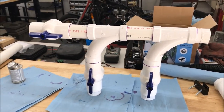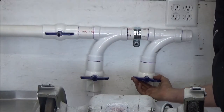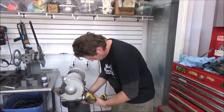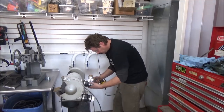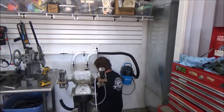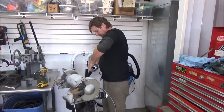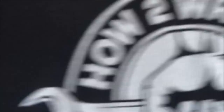Let's take a look at the setup. I'll glue that piece up to the pipe on the wall and get it secured. I was going slightly downhill to clear those outlets. One of my real deciding factors for this vacuum was the wall mount — super slick, and great to be able to grab it and go use it in other places. Those rubber coupling reducers made life really easy — didn't have to fabricate anything there. I even flipped the hose clamps so the tightening screw faces outward, thinking ahead for future maintenance. In the build list you'll see two sets of inch-and-a-quarter Shop-Vac hoses — eight-foot hoses cut to four feet each.